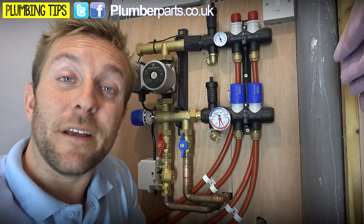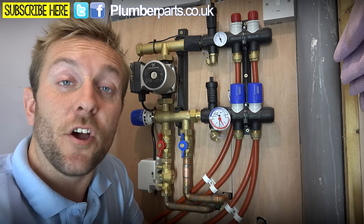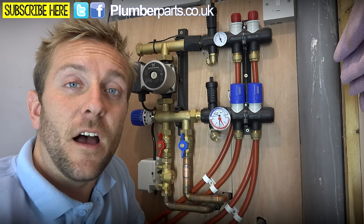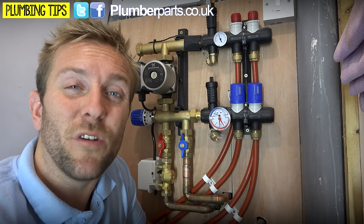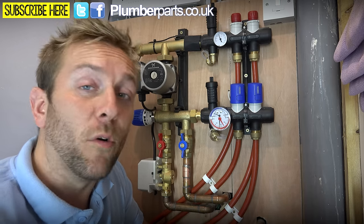So what we're going to do now is run this system for you. The screed has been down for 6 weeks now, so we don't have to wait. I mean, usually it's 21 days for the actual screed to go off, depending on how thick it is. And that is basically to stop it from cracking, or if there's any problems afterwards when you turn the hot water on. If it's still a green screed, it can cause problems later on in the job and be a whole load of hassle.